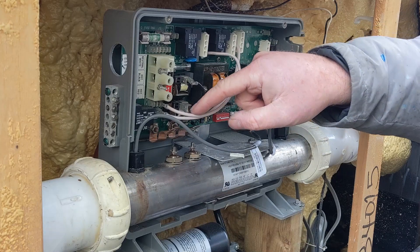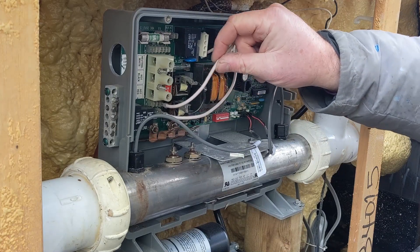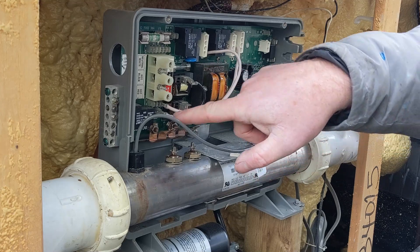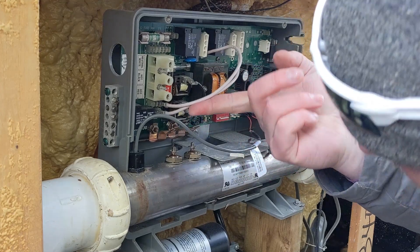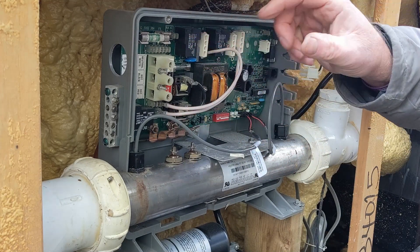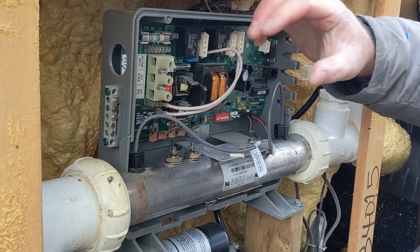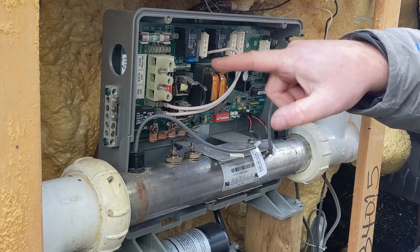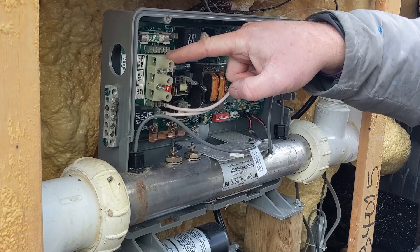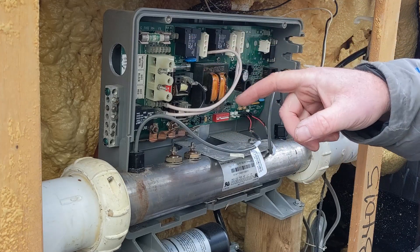You just got to look at these wires right here — these are wired to 240. So everything's going to be 240 volts. It says red AC, and there's white AC up there. Every VS comes wired to 120 volts, so all your white wires are going to be right to the top here into the white AC.